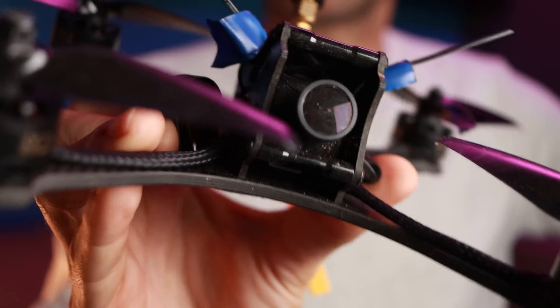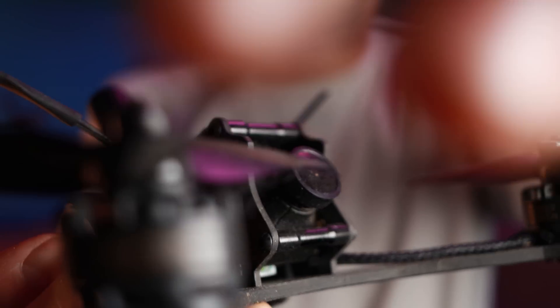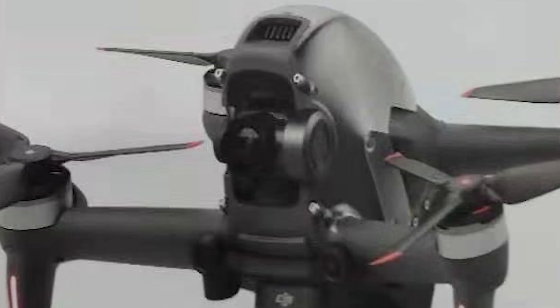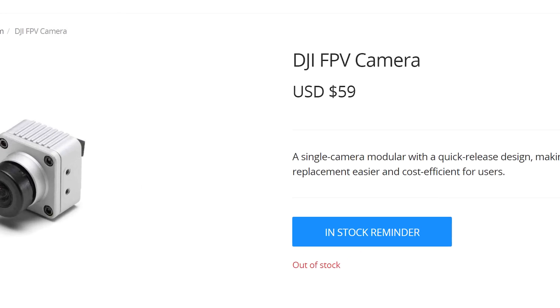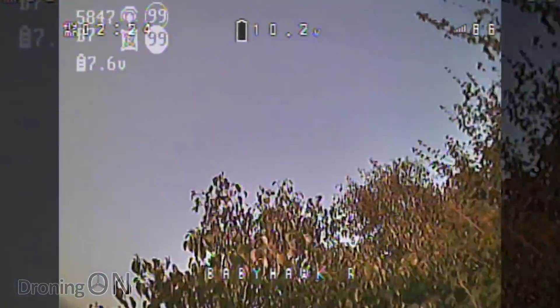With a quad like this one, nothing's proprietary — every single component, the antenna, the blades, the motors, the camera, even the flight controller, I can pick up another one for about twenty dollars. The DJI quad is going to be proprietary. Every aspect of it — from the airframe to the motors to the camera to the speed controllers, including the arms which can also be damaged in a crash — are all made by DJI. You can't buy them anywhere else. The camera we've seen in the leaks of the DJI FPV quad is likely going to be over a hundred dollars alone, especially as it appears to have a gimbal attached. With FPV, crashing is unfortunately inevitable, and even if this thing has obstacle avoidance it's highly unlikely to stop you hitting a tree at the speeds you'd expect an FPV quad to fly at.